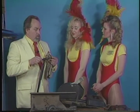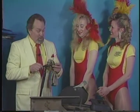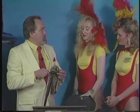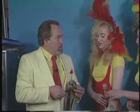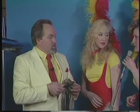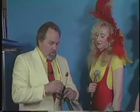And tungsten is, theoretically, non-consumable, but when you buy as many of these as I do, you start finding out they are consumable. Well, they're not really consumable. They get contaminated, and you have to grind them and sharpen them and all that. But they're not used in the process of welding. That's not the filler metal, all right? So that's the tungsten. The inert gas comes out of this cup around here.